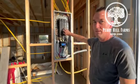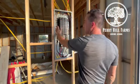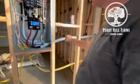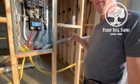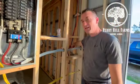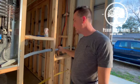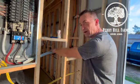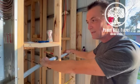We've been doing the electrical panel wiring. Glenn has helped me tremendously with this — learning this aspect nearly killed me. Look at my busted knuckles — I've got band-aids on. The stuff in this sleeve is four-aught SER cable — S-E-R — three four-aughts and a two-aught that I could not bend. Originally we were planning to come in over here under the box and then turn, but I had to keep the wires in the sleeve going through the wood. I could not get it to turn — I tried for probably three hours on two different occasions, an hour and a half each, working up a pure sweat in 35-degree weather.